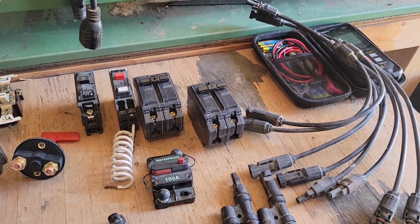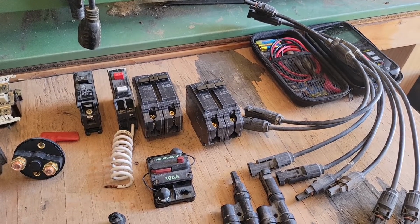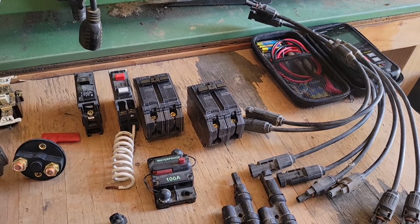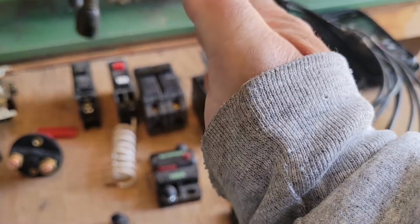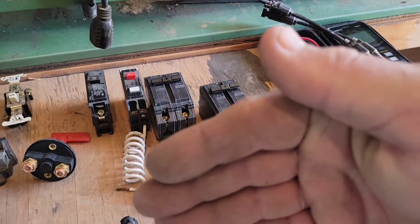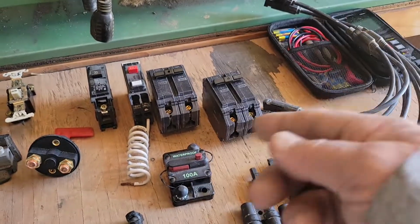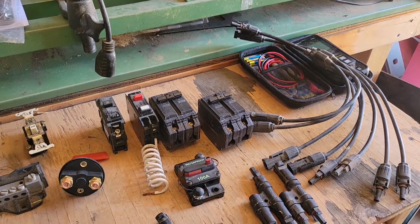Okay? Now, if you're going to buy a cheap Chinese unit that's designed for 50-mile-per-hour winds, and you live in an area where you constantly get 60 or 70-mile-an-hour winds, then yeah, you're going to want to upgrade your turbine. Don't put a brake on it. Brakes cause problems, okay? The original brakes they made was a hinged tail on the back end of a turbine so that they could pop a catch, and the tail would turn and align itself with the blades of the turbine, so the turbine can't be turned into the wind to catch the wind and turn. Those worked pretty good, but there are too many parts, too many things to wear out, so stay away from it.